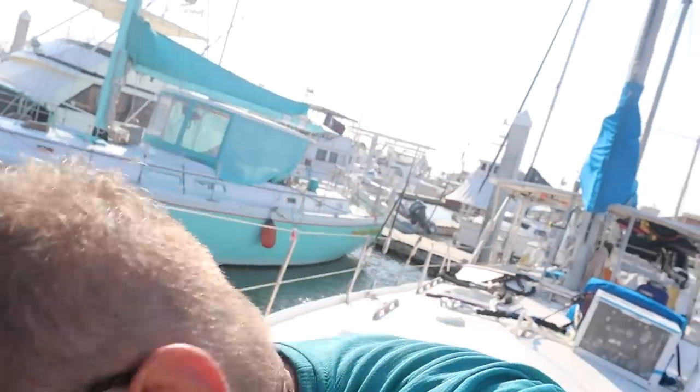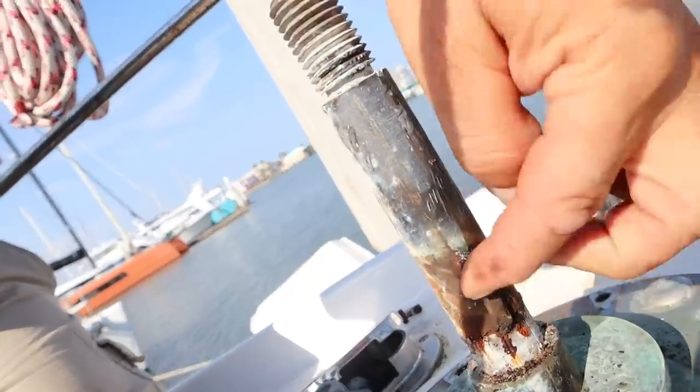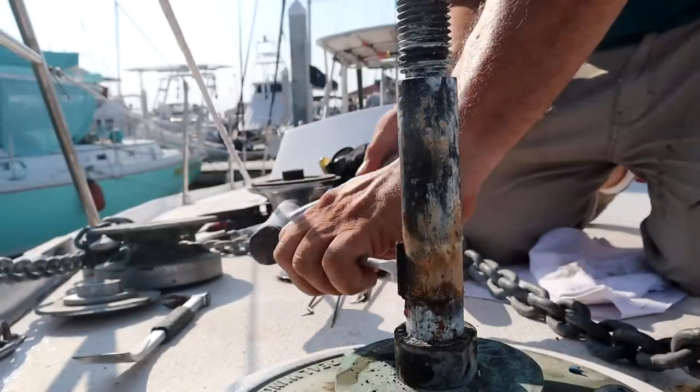There was a steel bolt in the chain stripper. It's all rusted. And it looks like maybe, possibly, somebody has put a steel key in the keyway on the shaft right here. It looks like that might be rusted in place. So, let's see if I can get that out. Steel, when it rusts, it expands, and when it expands, it gets stuck in the keyway. I'm gonna go get my little die grinder and clean up the shaft a little bit, and then I'm probably gonna have to soak that keyway in some more PB Blaster, maybe even for a couple days.